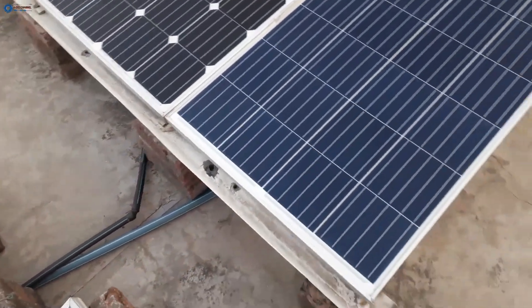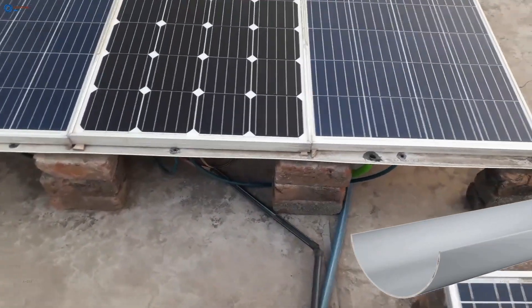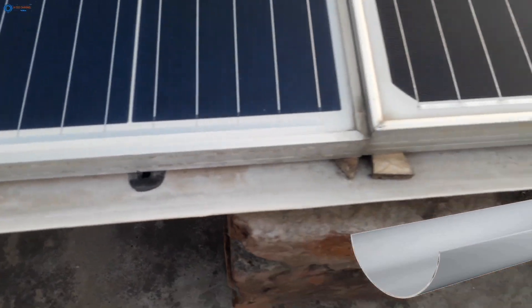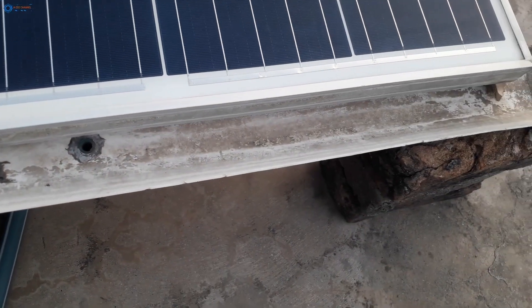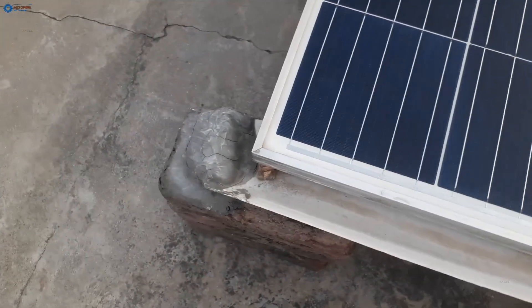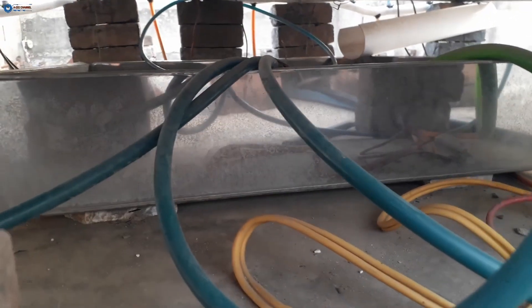This is another interesting area to see — the bottom side of the solar panels, the place where the sliding water will be collected. I have taken a PVC pipe and cut it in half, making it two pieces. I placed one piece under the solar panels so it will collect the water effectively. You can see the half slice of PVC pipe under the end of all three solar panels. Both ends of the PVC pipe are blocked so we don't want water to escape from its sides. You can also see holes in the PVC pipe — this is where the water escapes in a controlled way. The water is then transported back to the water bucket so it can be recycled.